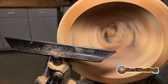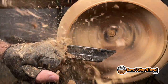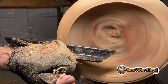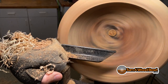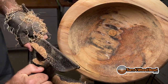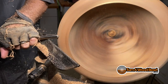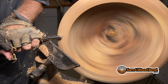The exterior of the bowl is pretty much cleaned up. I'm going to take my time and shape the rim of the bowl next. There's a high spot on there — if you notice, I'm moving from the right to the left off of that high spot. That is the supported grain cut direction. If you want to learn more about supported grain cut, I've got a video all about that. I've repositioned the tool rest and I'm making a scraping cut here to further refine the curve on the top of that rim, just taking my time and making a light shaving pass.